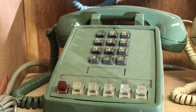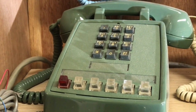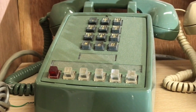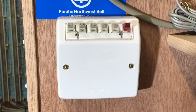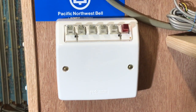Here's a 2564 and because it's a touchtone phone, this one did not have the intercom wired to it because the intercom is a rotary-only intercom. However, it does have the first four lines. This is a Northern Electric 6040 key strip. It will also be connected to the Northern Electric KSU.